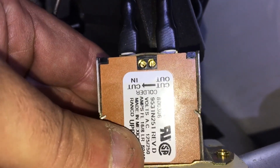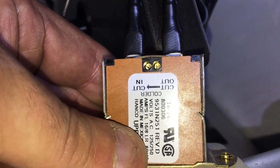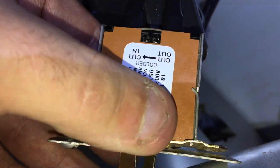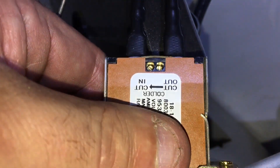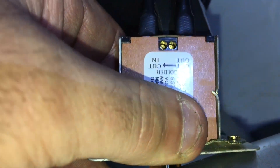So I'm going to go another half turn to get my 41 degree cut-in — that should drop me two more degrees down to 41, maybe somewhere between 40 and 41, which is exactly what I want.